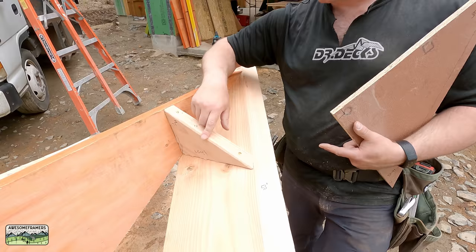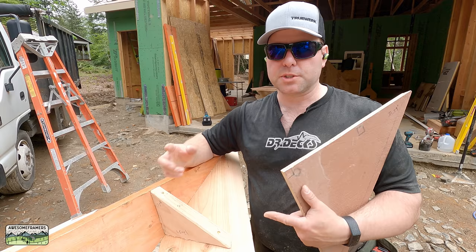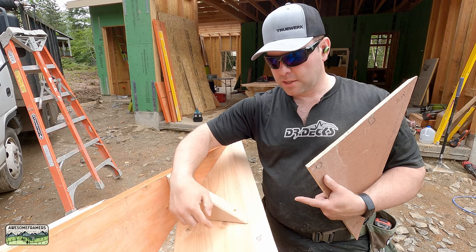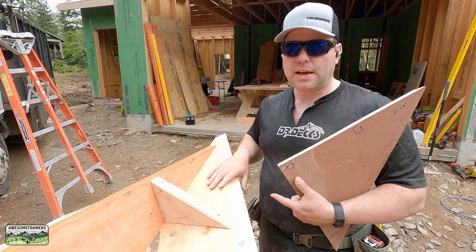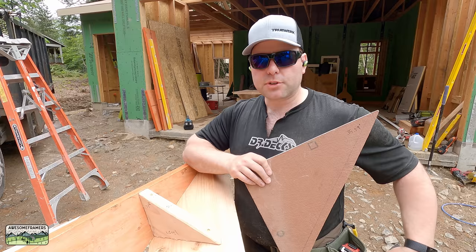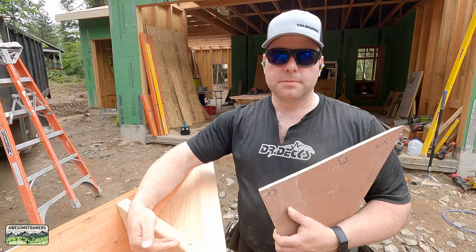For some of you, an over-frame roof is a great way to deal with split pitch. If your roof is a 7/12 but it's landing on a 5/12, you use a 7/12 plumb cut and 7/12 seat cut, but you set your saw to the roof slope you're landing on — in this case 5/12, so 22 and a half degrees in round numbers. You will always get these right without doing any math; just look at your speed square.